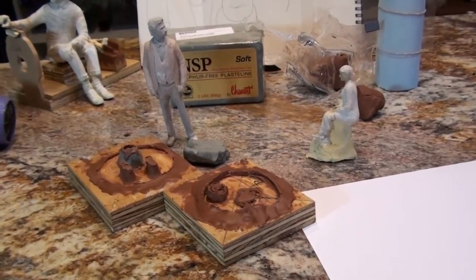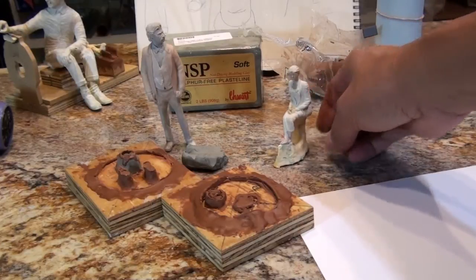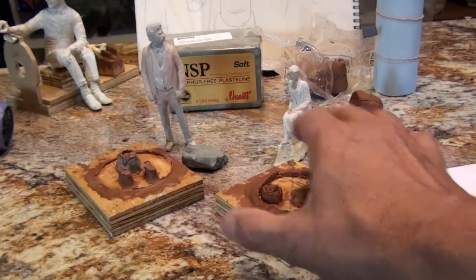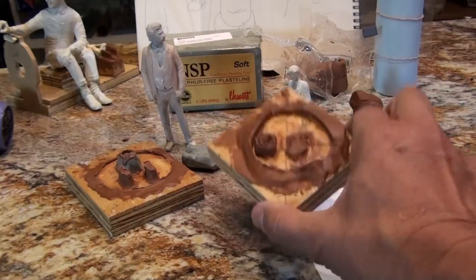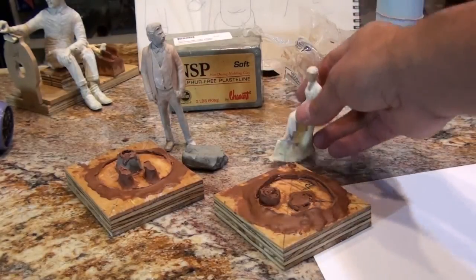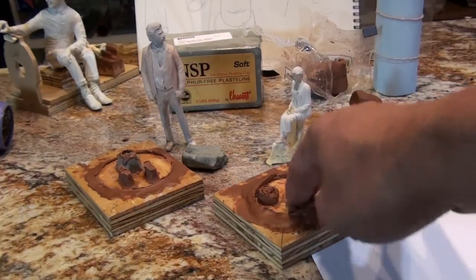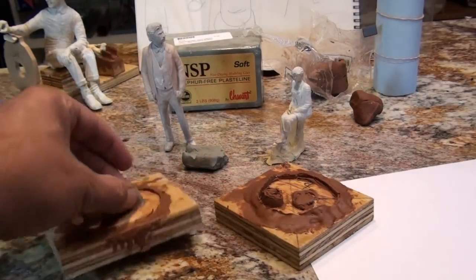Okay, the first two molds we're going to do are one-piece molds, and it's for my Mark Twain guy and my little 1/20th scale passenger named Harriet. The items you see in this frame are pretty much what you're going to need to set this mold up. Two pieces of wood that they'll rest on, and two types of clay. Now, sometimes you can get away with one type of clay, and that's fine. Harriet, for example, already has a base that's a polyurethane base, and that base is not going to melt, so I can pretty much just melt it into place on this board, and it's going to be fine. Mark Twain, however, doesn't, so I use this different, harder clay.